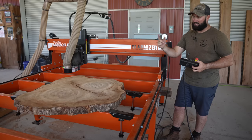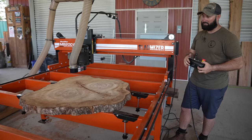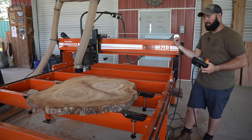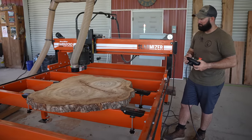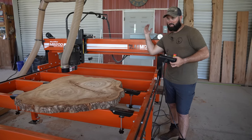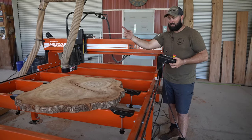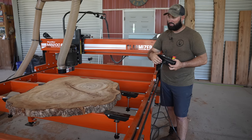If you try to go side to side, it leaves like hills, it does like climb cuts and it doesn't work as good. And if you try to cut this way, it leaves burning. It still cuts, but it doesn't cut a clean cut. To get your cleanest cut, you start on the side away from you and you work that way, and then you can take it over, come back around and keep working that way, or you can come back across.